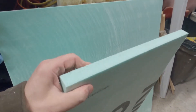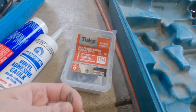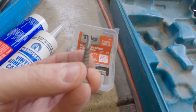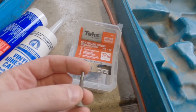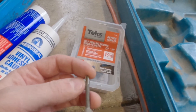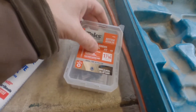Let me go through what I'm using to do this really quickly. First, I've got some sheets of three-quarter-inch plywood — this is poplar plywood, got it from Lowe's for about $49 a sheet. Then I got a couple of four-by-eight sheets of one-inch-thick foam for some insulation. I've got these self-tapping screws for attaching wood to metal. What's nice about these ones in particular — see those little tabs, those little ears — they drill out the wood so the teeth don't bind. So when the tip hits the metal, it doesn't catch the threads and push the wood away. It drills out the hole in the wood wider than the threads, and then when it hits the metal those tabs snap off. Pretty cool. I got a couple boxes of those.